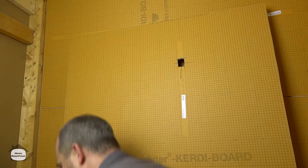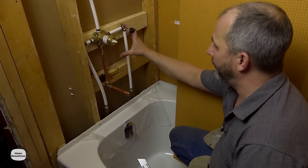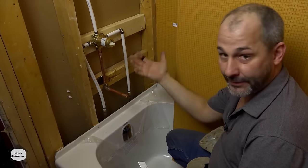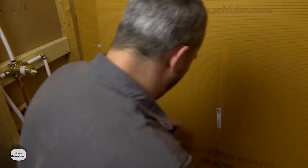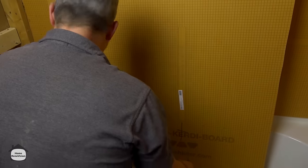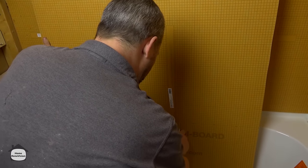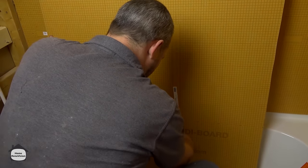Down here, I've got a shower control. Now, my cover plate is about 5 inch round, and it has its own gasket that seals up against the stone. So I'm not really that concerned about water getting in behind that part of the wall either. So I have a rectangle that I want to cut that is about 3 by 3 inches. That's where I'm going to start.